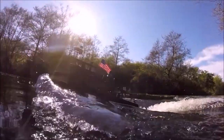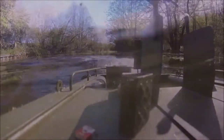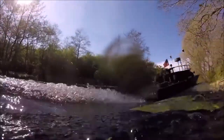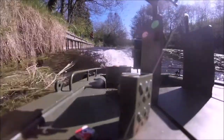It is however highly maneuverable and tons of fun to use. A couple of points regarding jet motors in general: though they can run in very shallow water, the jet intakes will suck in and jam with small pondweed, so lakes covered in duckweed and shallow runs full of silkweed should be avoided. Also, hitting big wakes or waves will deprime the motors, giving you a couple of seconds of lag before the jets reprime and normal working resumes.